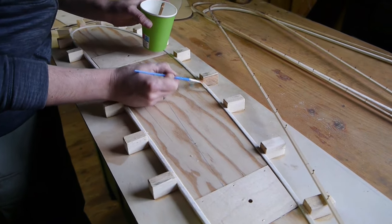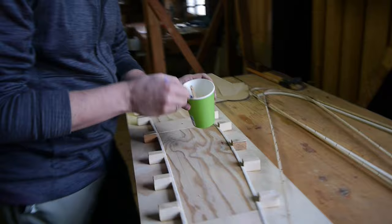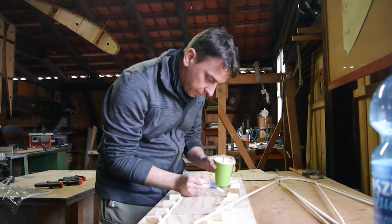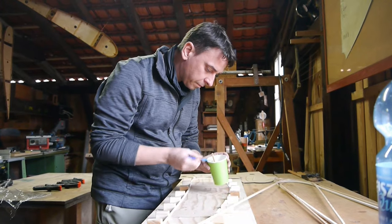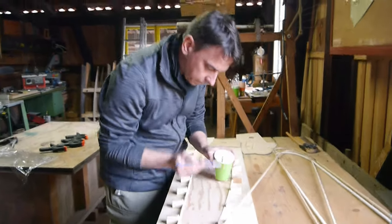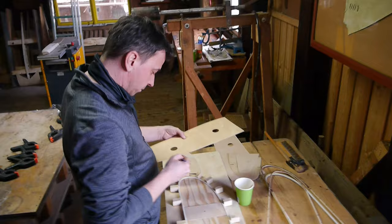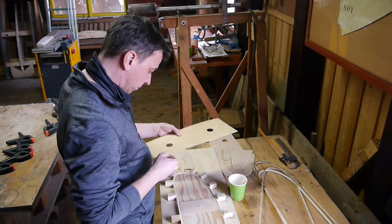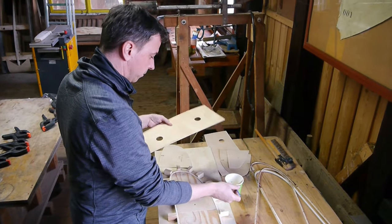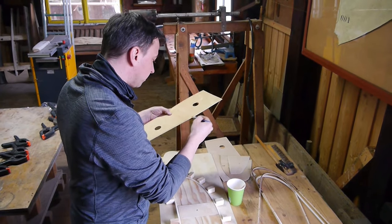This is the point where Aerodux wood glue does not work with the original Fokker building method. The viscosity of the glue is not sufficient to penetrate through the wrapping of the wooden cap strip to glue the underlying wood to the fabric. For this reason we use a resin from West Systems. The wrapped component is coated first so that the resin can absorb well into the fabric. Then the plywood web of the rib is also coated, and everything is mounted in the template by nailing — we nail through the unwound strip and through the plywood web into the wound strip flange underneath. Later in the video, Steffen uses the word 'glassy' to express the fact that Aerodux becomes so hard that it cracks like glass, making the fabric brittle. This does not happen with the West Systems resin.